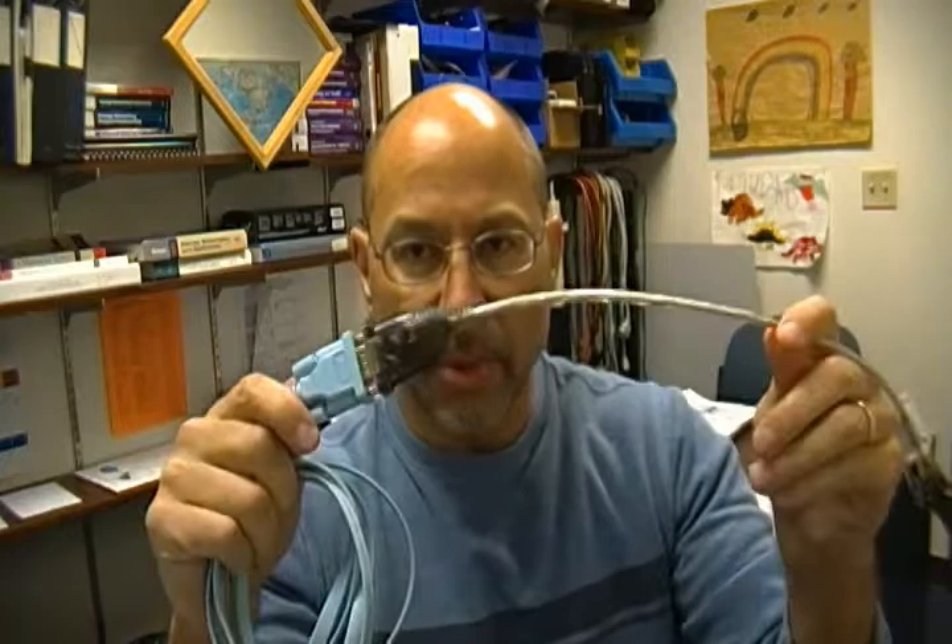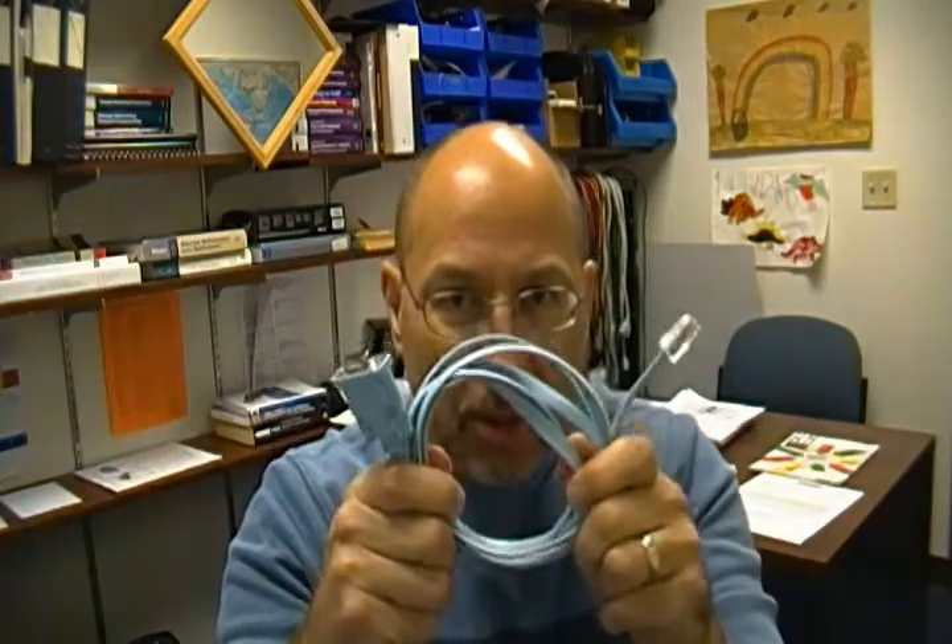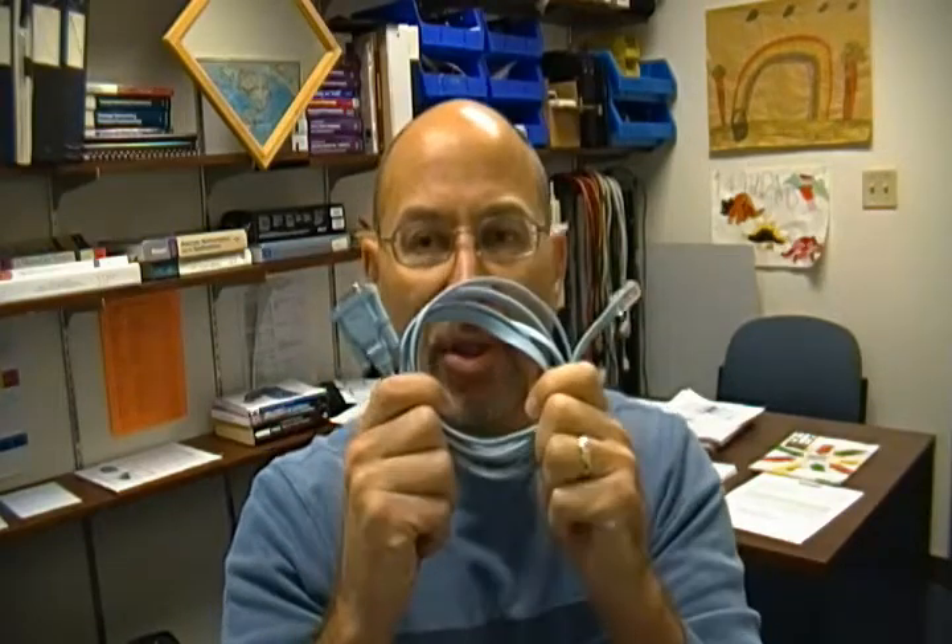Even if I do something clever and hook it up to a USB to serial adapter — so USB to serial adapter — this is a console cable. Console connections are synonymous with command line interface connections, COM port connections, and serial connections. The standard that we use to communicate over this is something called EIA232C, which is a serial communication standard.